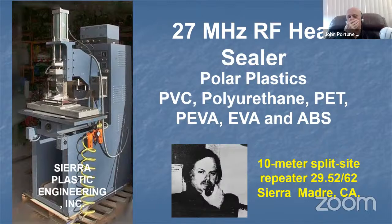Well, Sierra Plastics. I was running a 10-meter repeater from my home at that time. You can see me talking on it there on the local transmitter. The receiver was 3/4 of a mile away at another ham site. And I had a phone line in between the two of them because I didn't want to run a 10-meter duplexer. I ran a two-site receiver 3/4 of a mile away, transmitter at my site.